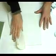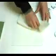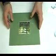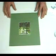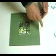The first thing you want to do is clean off your glass. Clean it off with glass cleaner once on one side, twice on the other side, and then that side goes against the work. Okay? Next thing we're going to do is build 3 sides of the frame so that we can lock our work into that.